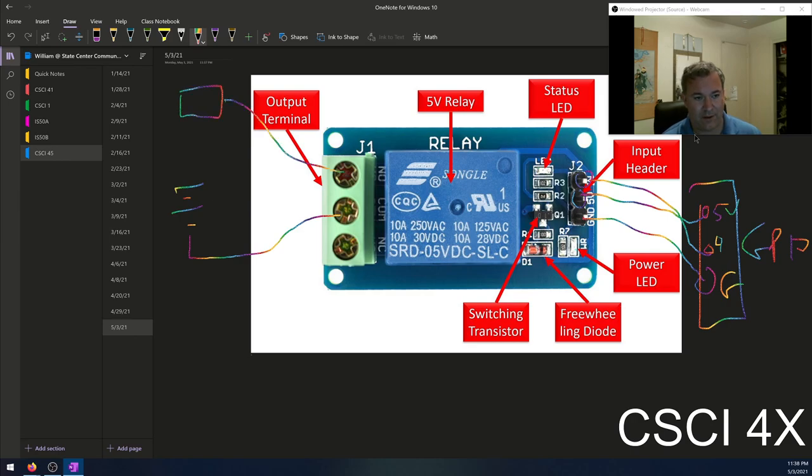And then you can have a little DC motor set up with a fan attached to it or something like that over here. And then that runs into there. And so when the GPIO pin goes high, you hear a click. Current flows through the circuit, the fan turns on. The Raspberry Pi goes off, click, the fan turns off. And so by doing this, this circuit here is all electronically isolated from your Pi. It's not draining power from your Pi, it's draining it from the battery. And there's various battery adapters and things like that you can buy if you'd like.